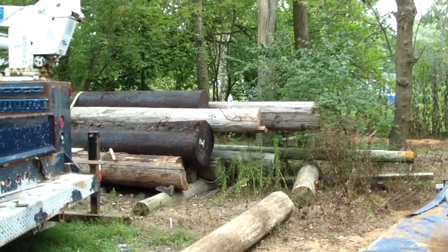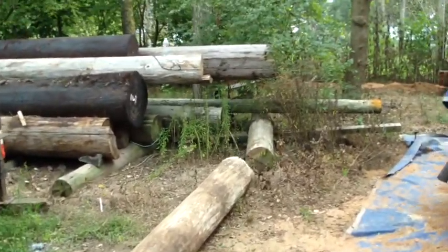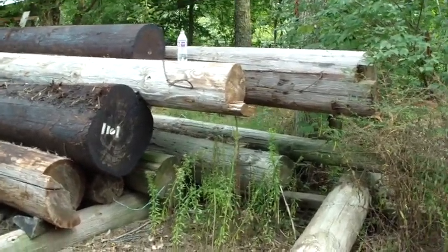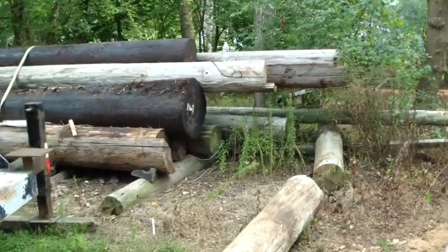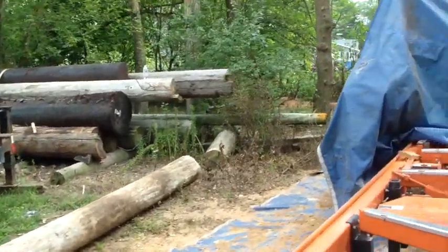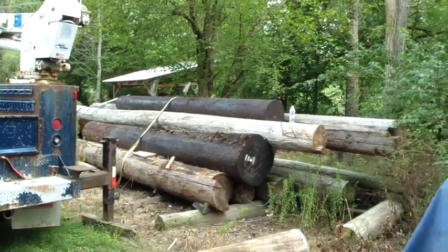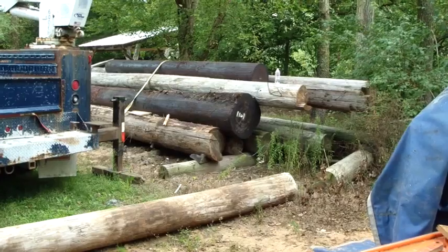If you get western cedar, it's good wood — it's real light and I like working with it for framing — but it is the worst wood I've ever sawed. It's really abrasive, so it gets the blade heated up and the blade starts to drop tension, especially on wider longer cuts. If you're trying to cut 20 inches wide, or even 16 inches wide, over 16 feet, you're not going to get very many cuts before the blade gets dull and loses most of its tension. When it dulls, it gets almost impossible to keep tensioned up — the blade will start waving, going up and down, and it'll eventually just dive so far it jams the mill up.